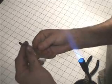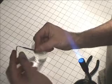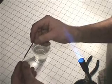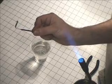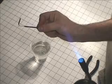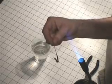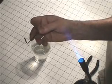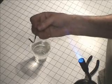You can do it on a grinder or use the Dremel. Grind the head to your particular length and width, and finish the end, round it off so it doesn't hurt your fingers, and you've got a perfect twist flex wrench. And that's it for wrenches. That's all I would recommend. If you do this heating and cooling more than once, the carbon steel will get very, very brittle and will snap. So be careful only to heat and cool once.